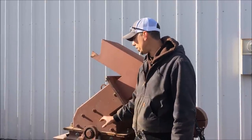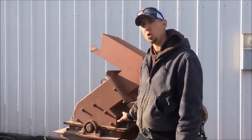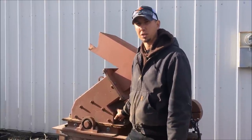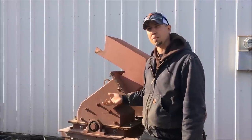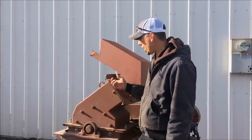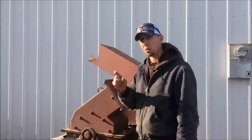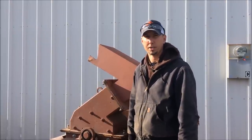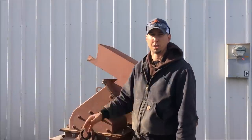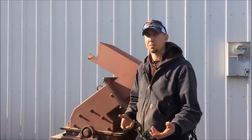The armor is bolted in by these bolts here. We have pretty much the whole inside of the case covered in armor — it's AR400 high abrasion resistant steel armor that's 3/8 inch thick. Our hammers are high chrome or high manganese depending on your application. The screens are either AR400 steel, or the thicker ones used primarily for scrap metal in our larger HD 24x16 hammer mills — those are 1 inch thick steel plate that we break into the contour needed to fit into the mill. That's a rundown on the hammer mill wear.